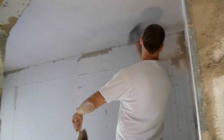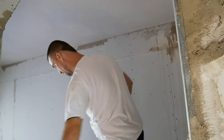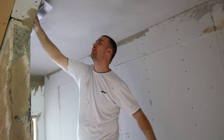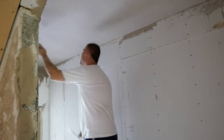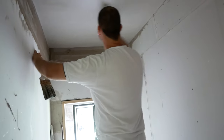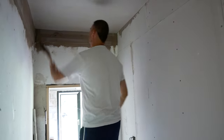Again, a plastering trowel, some of these trowels, I guess the trowel for instance here has been brilliant to get out of the box, but most of your normal skimming trowels that you buy still need a wee bit of breaking in. Even if they're ready to go, they will leave a couple of wee lines, and you'll find the more you plaster, the more you use that trowel, you'll get better, as you will get better with time, but the trowel itself will actually get better because you'll be breaking it in and it'll wear in, and it'll feel more comfortable to hold, and it'll actually leave fewer lines because it's not got such a sharp corner or such a sharp bevel on it. So it will glide over the plaster better, take the lines out better and smooth the plaster in faster, and with less concentration, you'll find. As you speed up and the trowel becomes more broken in, it'll also help you speed up, which is great.